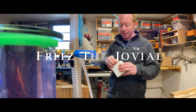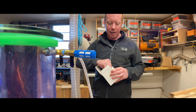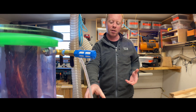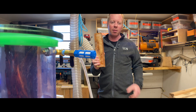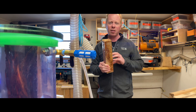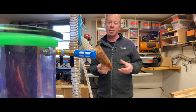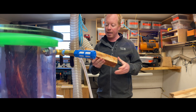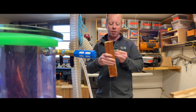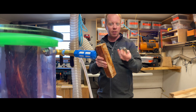We're playing with magnets — powerful neodymium magnets — and we're making a knife block. The other day I was in a store and I saw these beautiful knife blocks but they're like three and four hundred dollars. In a previous video you saw me stabilize this wood. This is a weeping cherry tree that had been rotted and burled — it's all pretty chewed up wood — but we stabilized it so now it's hard as a rock. I'm going to put these magnets and bury them into the wood and then build a knife block, and then your knife will stick to the wood because of the magnets.